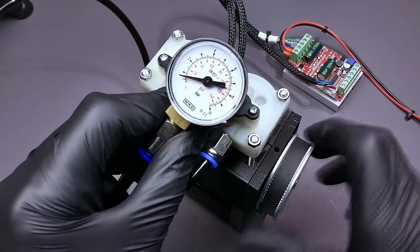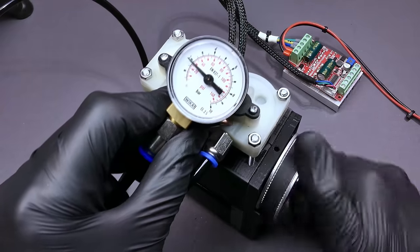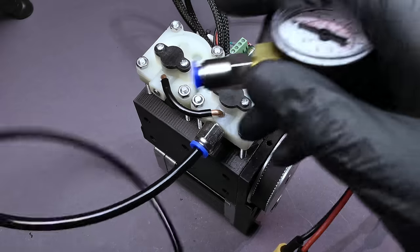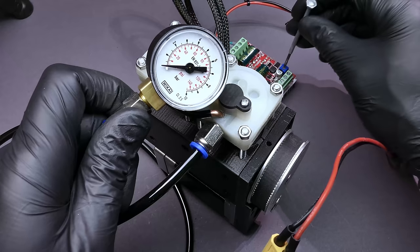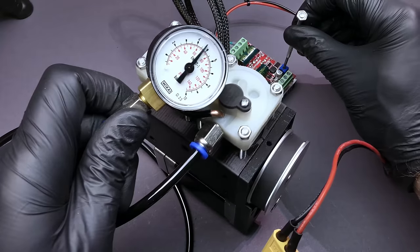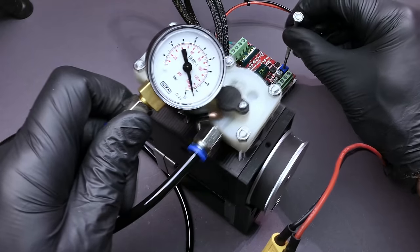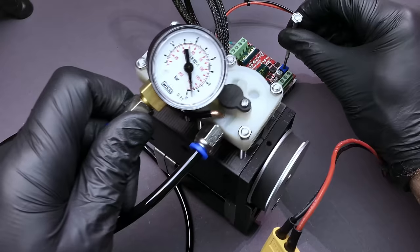As you can see, the compressor can operate at arbitrary low RPM and even works when driven by hand. It has a compression ratio above 10 to 1, enabling it to reach 10 bar or 150 psi. In each revolution, about 14 milliliters of gas are compressed by the two pistons. In the background, you see the brushless motor driver used to power the motor at variable speeds. Due to the belt reduction, it is able to start even when pressurized.